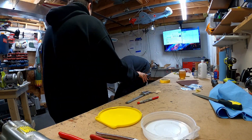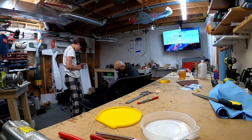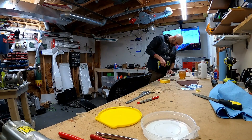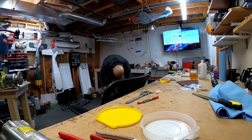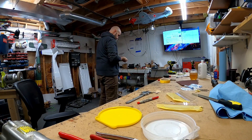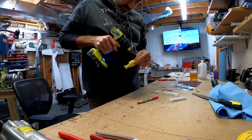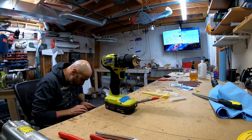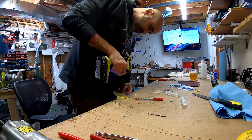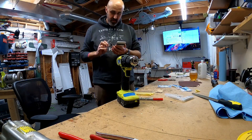This is where it cracked and I was just like, oh well, that's the end of that. I think I was also trying a different drill bit. When I was drilling it I heard something — the bit was making chips instead of gently going into the plastic. That should have been my cue to stop, because making chips with this plastic is how it cracks. Uneven stress is also how it cracks.